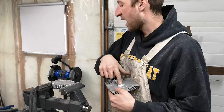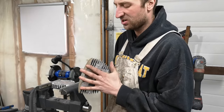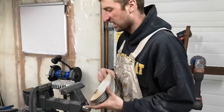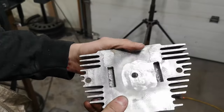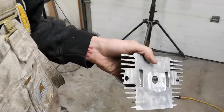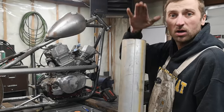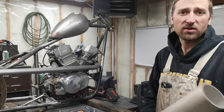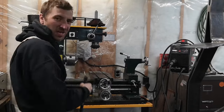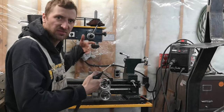So I'm going to mill this down and push this guy out. I'll get some half-inch or so material and mill in some slots. This is just too much of a pain in the ass — look at how much porosity is in that weld. Yucky. We can do better. I ordered material. It's not going to be ready until tomorrow morning, but it is half-inch, so I know how wide this is going to be. I'm going to do everything but the end caps. Just spent all that time making a big mess — that's all I accomplished.